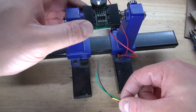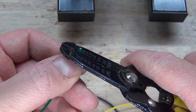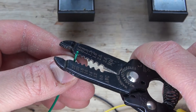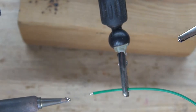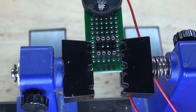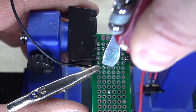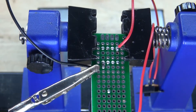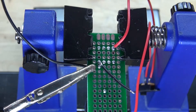Take four colored wires — these will connect the ATtiny85 to the 8x8 LED Matrix. Remove the insulation on one end, making sure one end is longer than the other: the longer end connects to the ATtiny85 and the shorter end connects to the 8x8 LED Matrix. The negative wire connects to pin 4 of the ATtiny85. The longer wire goes into the perf board and bends over to pin 4 — solder bridge it to pin 4. Take another negative wire, solder it to pin 4, and then solder it to the negative terminal of the 3-volt button cell battery holder.